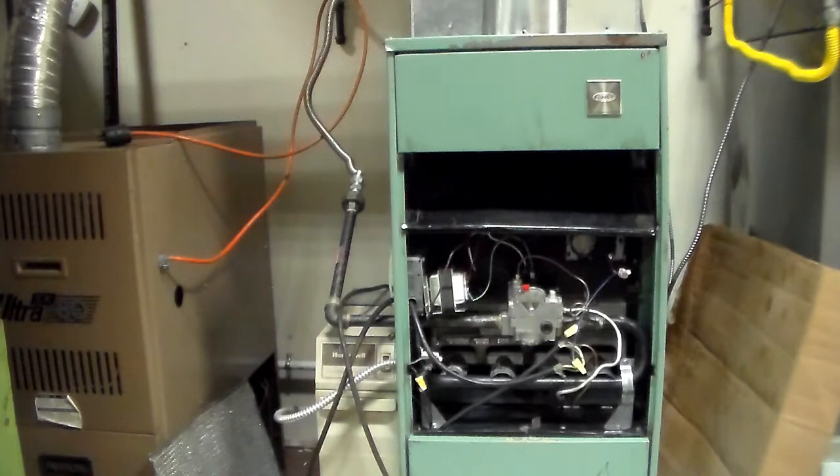Compare your reading to the label. If you're outside what the label says, the only way to fix it is to adjust the airflow — do not say adjust the gas, because we already clocked the meter. The easiest way to adjust airflow is to adjust the fan speed. If delta T is too high, speed up the fan. You could also add or subtract duct. If delta T is too high, give it more duct air.